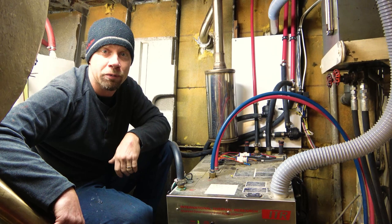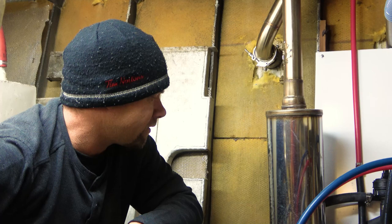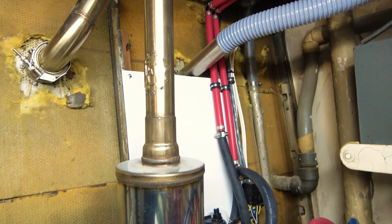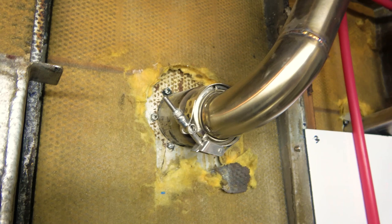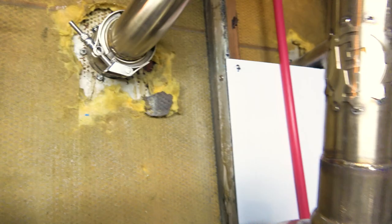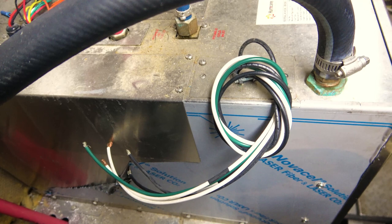We've been really happy with this unit. The exhaust is another custom piece we did — it's a Magnaflow car muffler, but it works really well for what we use it for. We did a test fit and built up our own gooseneck for the exhaust, and Sean at the shop welded it up and took it upon himself to put the Carmina Performance shop logo on the side. I fabricated my own isolated through-hull — I don't use the through-hull for intake; there's a separate intake tube on the far side. The stainless steel metal is just there to isolate the heat from the pipe coming through the hull.